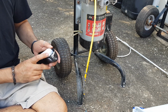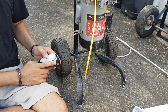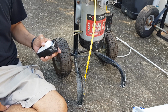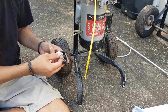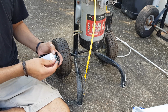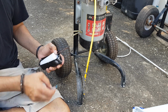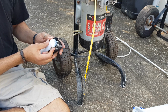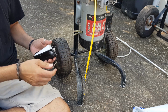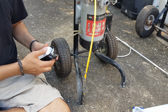Oh, damn it. Okay, so I am going to go and grab an angle grinder and just nick these terminals back. Probably 5mm, because I'm going to be soldering these on there, and then covering them with some heat shrink. We'll be right. We'll get that in because I'm sure this will actually push down then, all the way. This will actually fit in there. It just means I don't think I can use that bit of paper, but that's okay. I don't know why they put that paper in there.